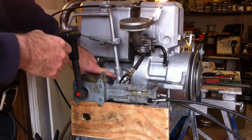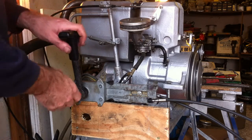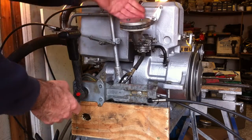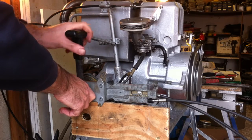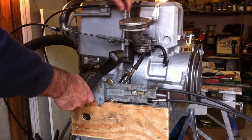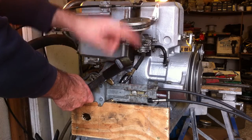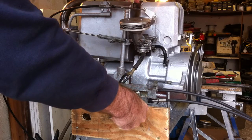It's currently in neutral, which means that this pin in the gearbox is in, and there's a little bit of slack everywhere, which is nice. No throttle, of course. First thing we do when we go forwards, it'll put it in gear first and then move the throttle. So first motion is it goes into gear — there is a little bit of free movement here, you don't want that tight — and as you continue, it pulls the throttle on, and that's fine.